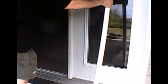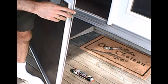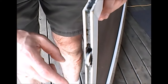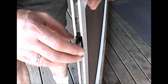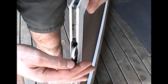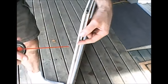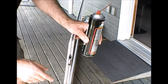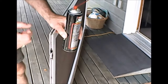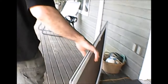Lift the bottom out, then lower the top, and now you get a great view of the wheels. Here are the top wheels — you can see them spinning nicely, and they're spring-loaded. When we took the door off the first time, the wheels were quite stiff and one of them would not spin at all without an incredible amount of force. So we pushed the wheel to the side, got a can of silicone lubricant, sprayed the little axle it spins on from both sides, and spun it around a few times. That's how we lubricated them — do all four wheels like that.